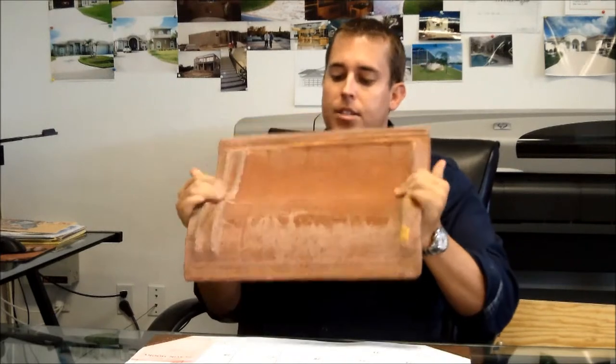In addition, when it comes to tile roofs, we only use concrete tiles. This concrete tile probably weighs about 35 pounds — it's really heavy and you can see how thick and strong it is. Although a lot of builders promote clay tiles because they have a pretty appearance and each tile has a slightly different shade, clay tiles are not sufficient for construction in Florida. After Hurricane Charlie, here in South Gulf Cove where my model home is located, there were several homes built by a builder that used clay tiles — which actually cost more money than concrete tiles. After the storm, the tiles were ripped off the roof, became projectiles in the wind, and destroyed the windows and roofs of nearby houses.